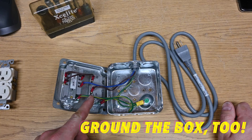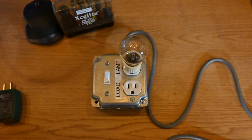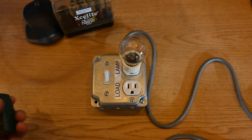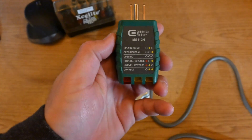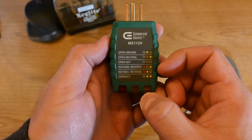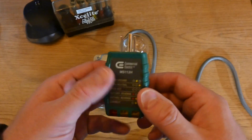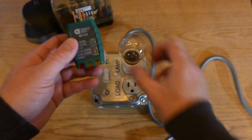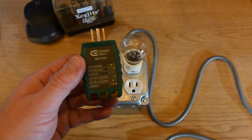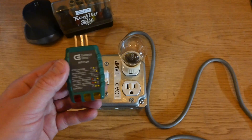You also want to make sure to ground the switches. The first time you plug this in after assembling it, make sure to plug it into a GFCI protected outlet in case you made a wiring mistake. I have one of these outlet testers here — if you look at the chart on it, if it is correct it should light up the two neon tubes on the right. The benefit of wiring it the way I did is that no matter which outlet the bulb is in or which one the tester is in, they will both show that they are wired correctly. If you follow some other videos on YouTube where they only break the tab on one side and don't have the jumper wire, one of the outlets will be reversed, which is not ideal.